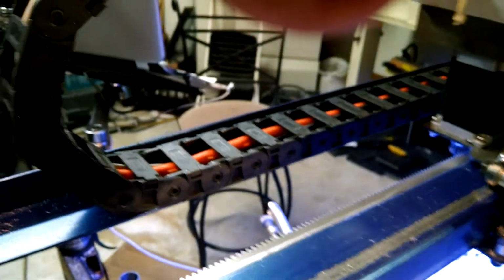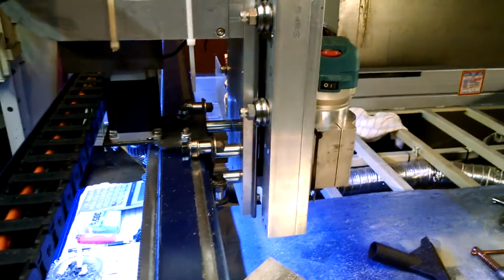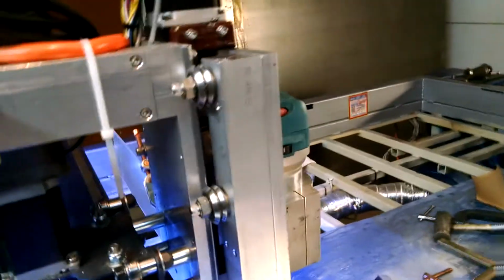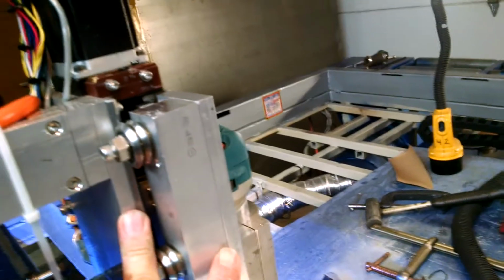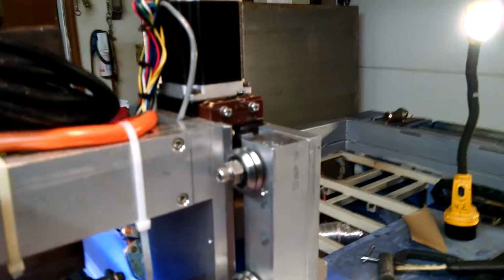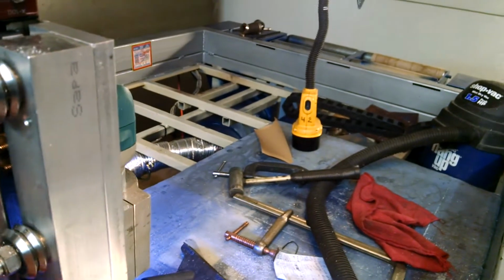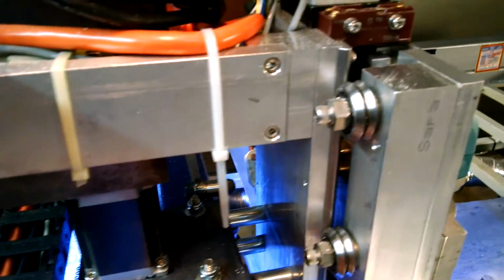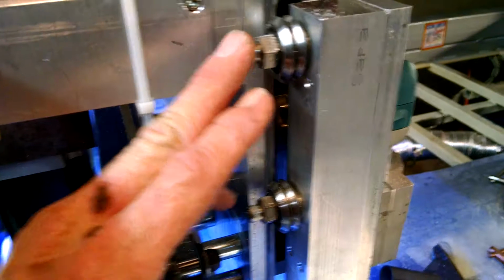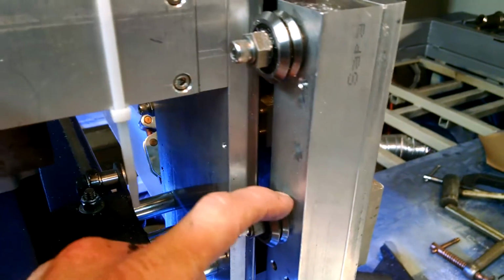We're just going to invert this principle and run it horizontally instead of vertical. And I thought about the same dimensions because it worked out so well. Because these were 2 stock plates that I bought. I think it was 5 inches and 7 inches wide, with the wheels being about 1.5 inches in diameter, and using 1.25 inch stock to make the stiff plate, basically stiff back, strong back, whatever you want to call it. It gave me plenty of room to drill and mount that. Or drill and tap it is what I did for 1/4-20.